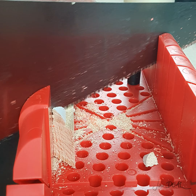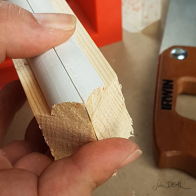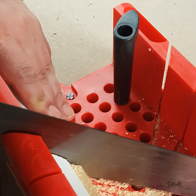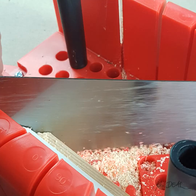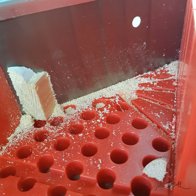This end is angled outwards, the wrong way. Line it up with the right hand 45 slot and cut. Since we're cutting two pieces the same length, I'm just going to line up the two cut ends, mark the next piece and cut it to length, making sure that both ends angle in towards the center of the piece. We'll repeat these steps with the 3 foot or 36 inch pieces.